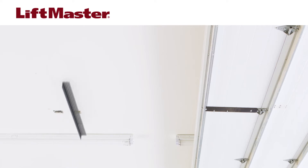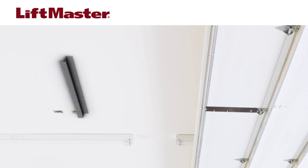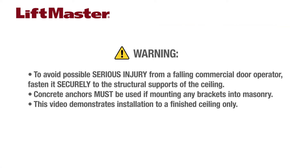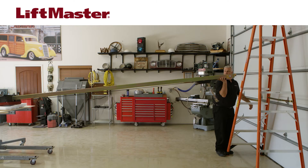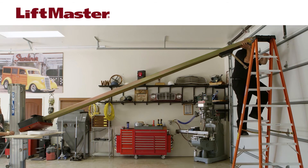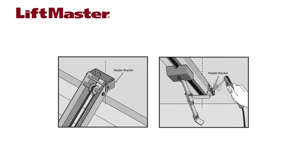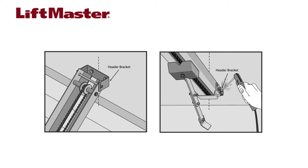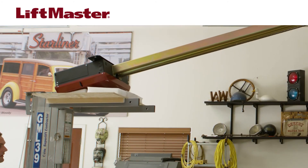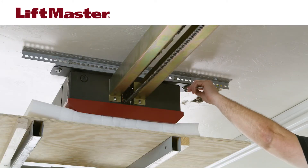For this demonstration, we've mounted a support bracket to structural supports in the ceiling, then added a second support bracket for the motor unit to attach to. If you choose to mount the motor unit using support brackets, you will need to supply them. The commercial door operator must be fastened securely to the structural supports of the ceiling. Concrete anchors must be used if mounting any brackets into masonry. Work with a helper to position the operator and rail so the header bracket is centered on your mark or the support bracket you've installed. Be sure to keep the cover protected by moving the protective packaging material along with the operator. Bolt or weld the header bracket to the wall or the installed support bracket, using the proper hardware such as concrete anchors if applicable. Lift the operator and align it with the mark or support on the ceiling. You can prop the operator up on a ladder or use a material lift. Bolt or weld the operator to the ceiling.